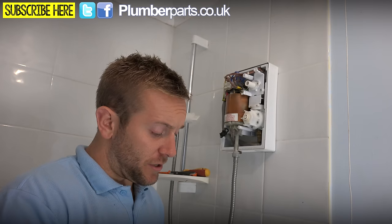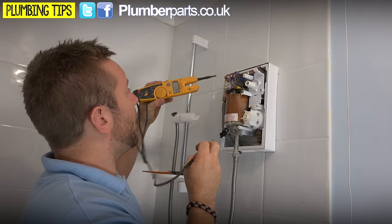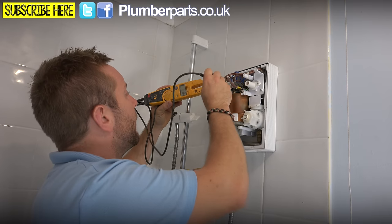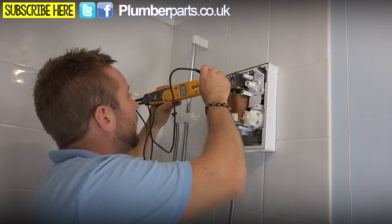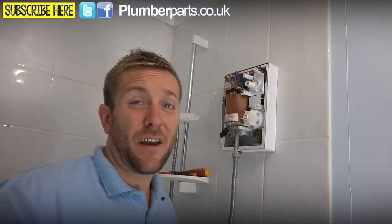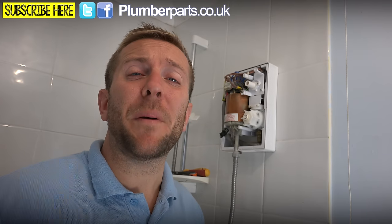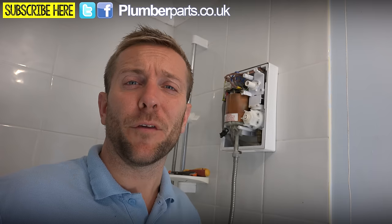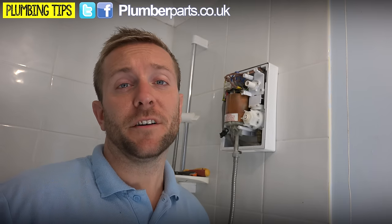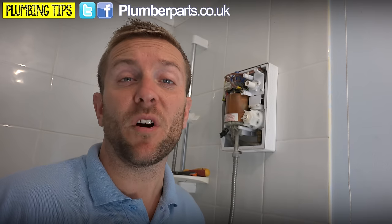But I'm just going to use my electrical tester here to make sure that everything's dead. So, pop that on my live. Cool, everything is definitely dead. Now that I know that the live supply is definitely dead and I'm not going to get blown to pieces by a vast amount of electricity going through my brain, I can now remove the wires. As soon as we've done the wires, we can then think about slackening off the water supply because we know we've already got that turned off.